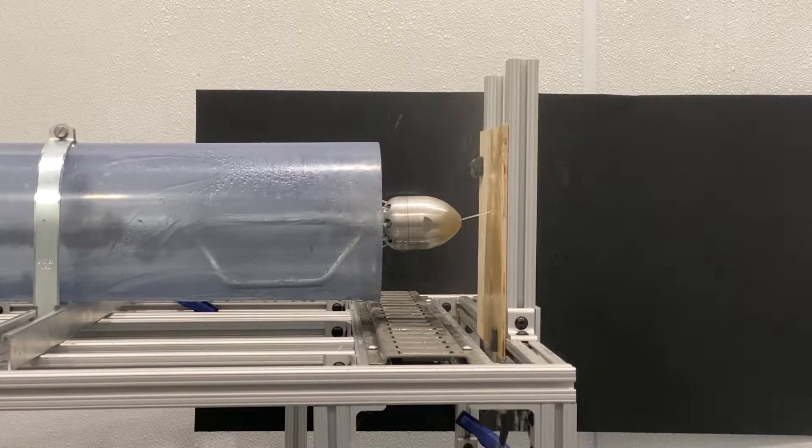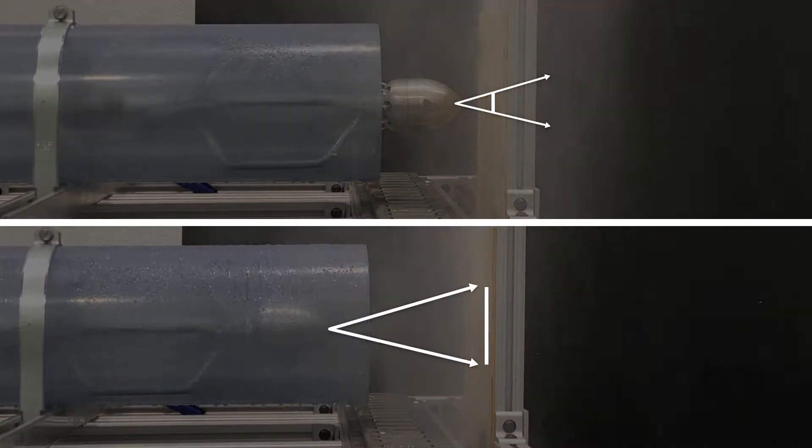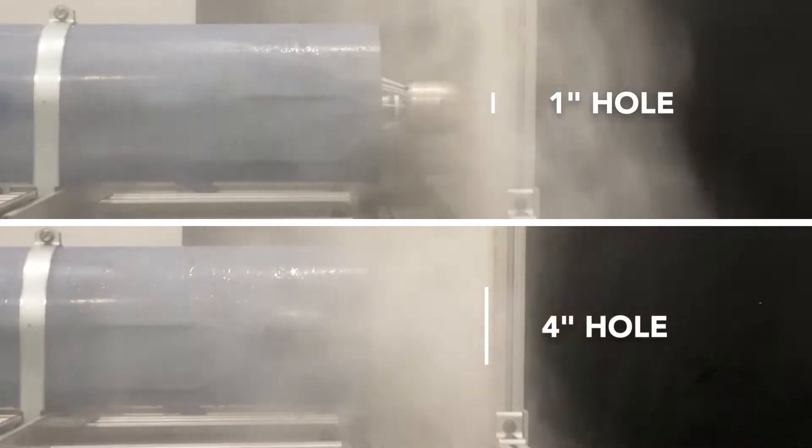We designed the Reaper to hit these specific angles to allow you to get much closer to the blockage and therefore cut through much quicker. When you arrive at the blockage with the Reaper, we recommend that you pull the nozzle back to take advantage of the entire cone angle, cutting a much larger hole much faster.